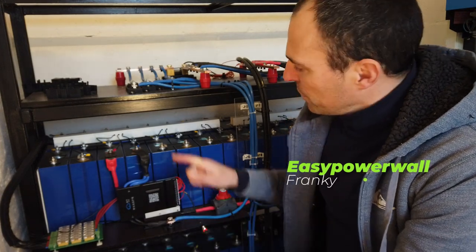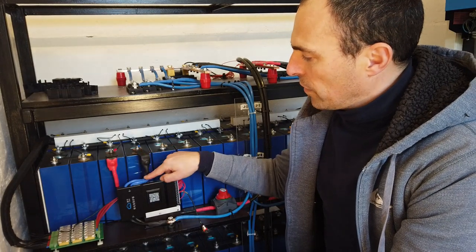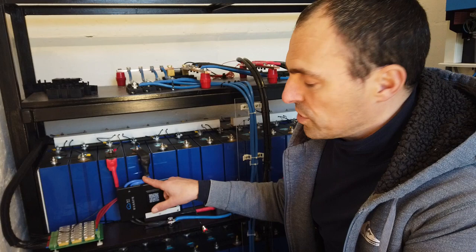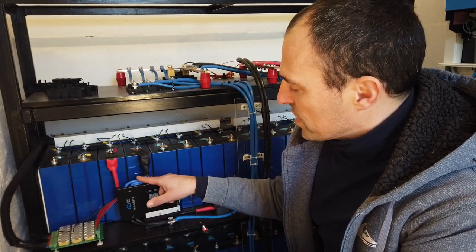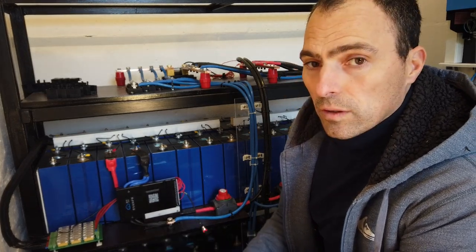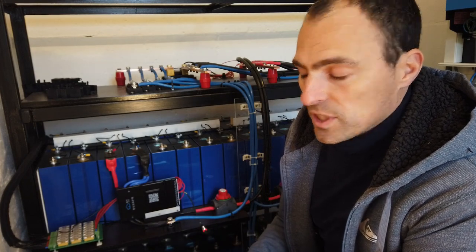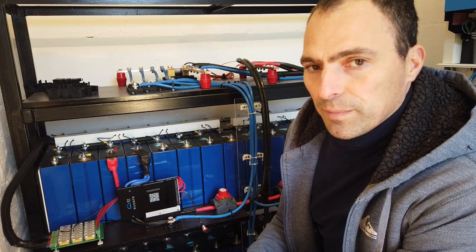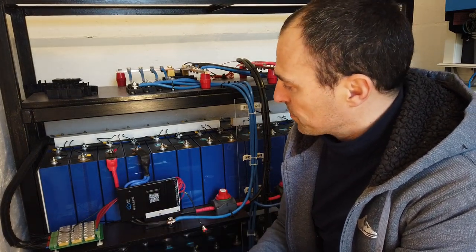In this episode, we focus on making the bus bars and making the connectors for the BMS. These are not off the shelf because I couldn't fit the two wires from the BMS into one connector. So I used copper that is used for hot water systems, and I adapted it to make it useful here in the Powerwall. Of course, the process is in the movie later.